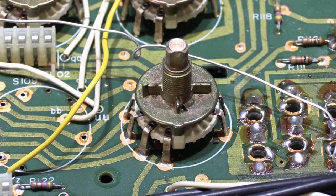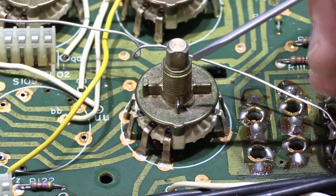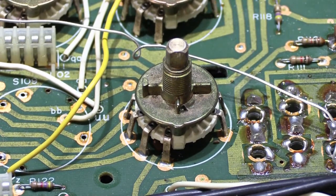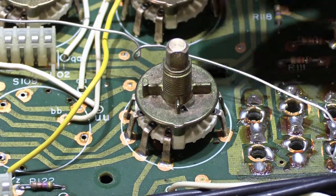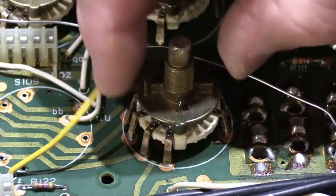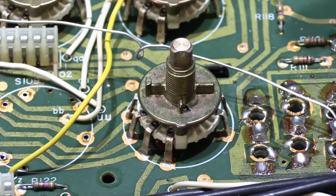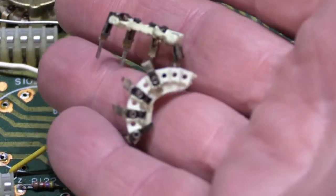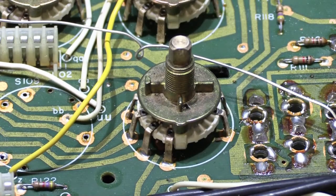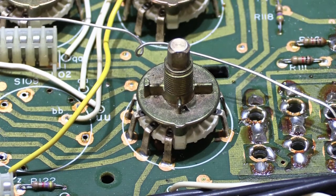The knobs are plastic, but they have a metal sleeve insert that is sort of a D-shaped insert that fits on the D-shaped shaft here. They sort of get stuck in place and they're very hard to get off, and if you pull on them incorrectly, what you're doing is you're pulling up on the top half of the switch, the metal part, and you can see how it kind of wiggles and wants to pull out of the plastic half of the switch. That oftentimes results in the plastic part of the switch cracking in half, and then the switch has to be replaced. SM428s are rare enough that you just simply don't see a lot of them floating around to buy that you can scrap out for parts. If you break something, you got a real problem.